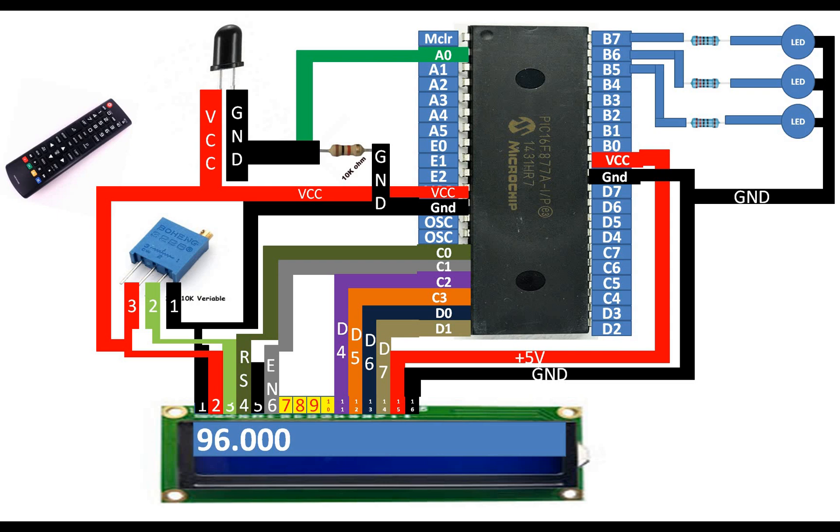When we use a TV remote on this sensor, we'll program it to display raw ADC values on the screen. When a button is pressed from the remote, all three LEDs — green, red, blue — will blink, and it will also display the raw value on the LCD. This is our simple and easy project, so let's get to hardware and programming.